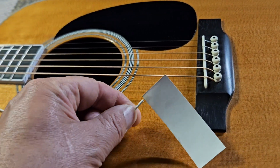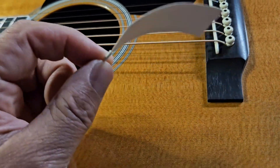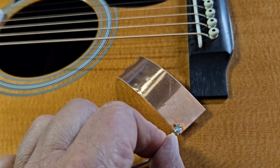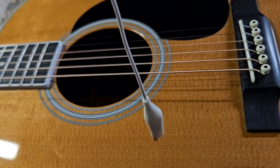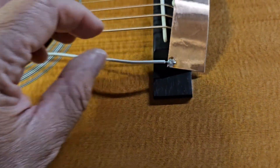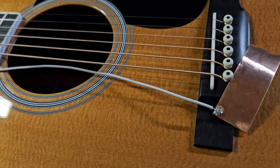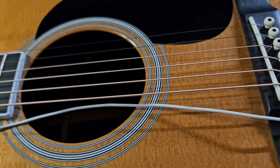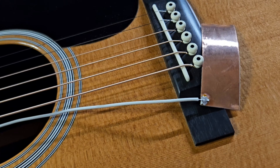This is a very simple and elegant solution. What I have is a piece of copper tape with a sticky back, and I have soldered a wire to the bottom right-hand corner of the tape. On the other side I have a crocodile clip, which means I can install this in the guitar and clip the crocodile clip to the shielding of the pickup wire right at the end pin jack, so it's out of the way.